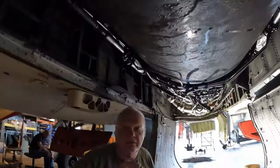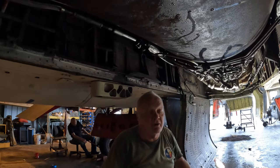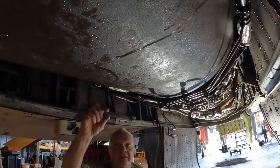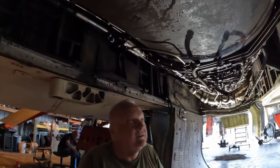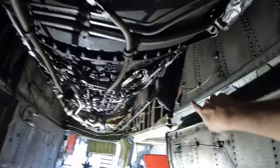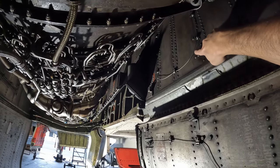The nozzle position is indicated as open, one-quarter, half, three-quarters, and closed. When the engine is running at 100 percent it's at three-quarters closed, then as soon as you go into burner it goes back to wide open. This is the outside of the burner can — inside there's a thin layer of cooling air to keep it from burning up. And if anybody's familiar with the howl of the F-4, that's caused by this short nozzle design. These little wires around the engine bay are part of the fire detection circuit.